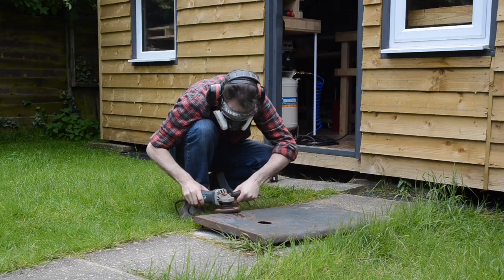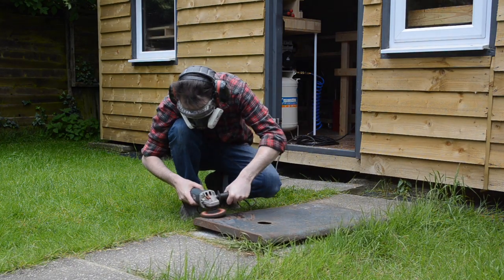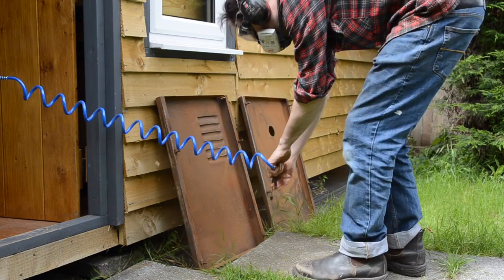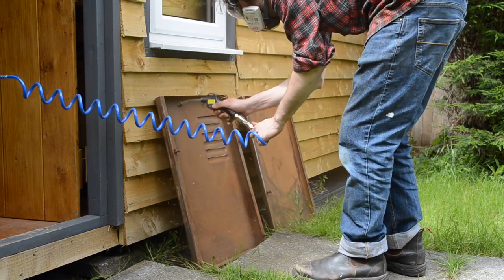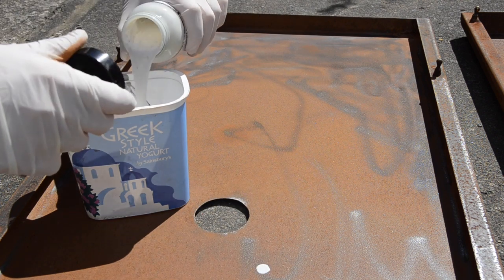The saw has these two side panels made out of pressed steel. They've got rust on them and a bit of surface loose paint. So with this abrasive disc I'm giving them a clean up. With most of the loose stuff removed I just use the air duster to clean it all off. Then I'm going to give it a coat with this rust converter.